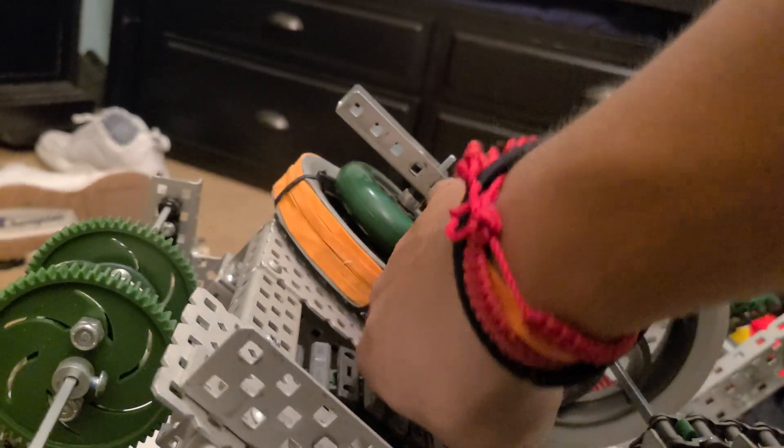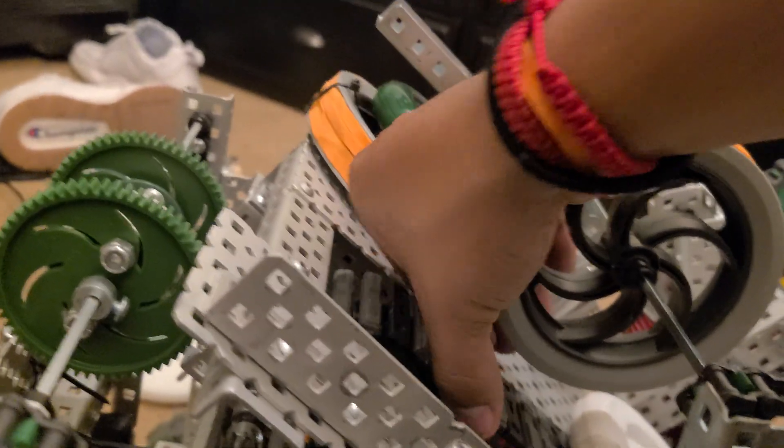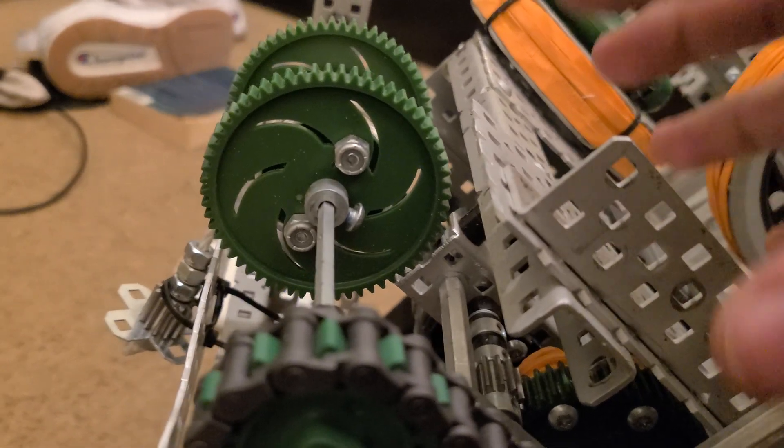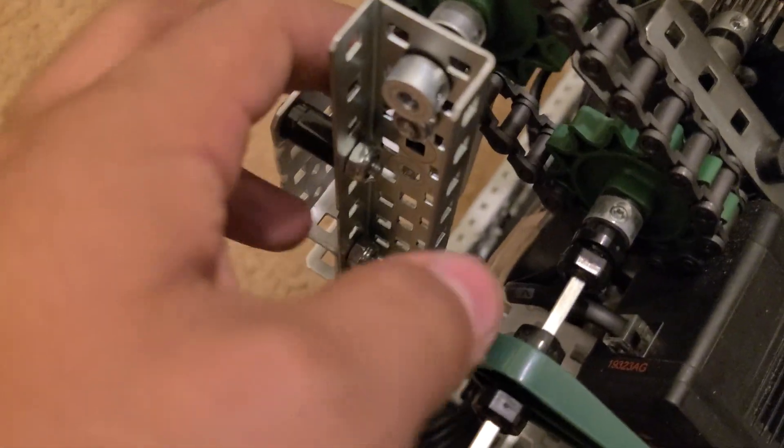The conveyor belt goes forward — you hear that click? That click means the sprocket bounces and jumps. If it goes backwards, it pushes the screw against the ratchet right here. You can see the ratcheting mechanism — the rubber band and stuff. You see that little screw jump? It pushes it back forward when going backwards.